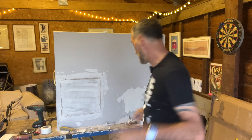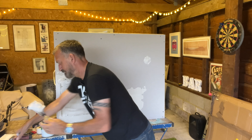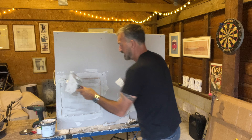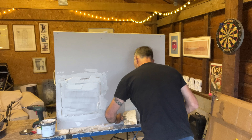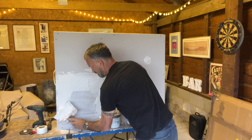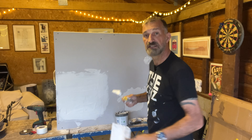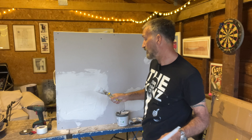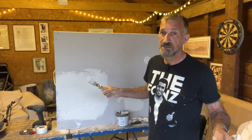Second time for me, first time for you guys. So let's take our filler — nice big dollop onto the big spatula. You can use a small one, but I find the bigger spatula a lot easier; even a plastering trowel will do. Get a first coat on — it can be pretty rough. Get it all sanded down, let that dry, and then put your second coat on nice and smooth. Bob's your uncle, ready to paint.